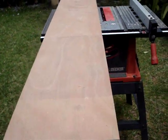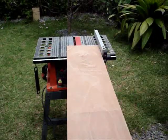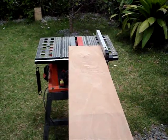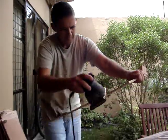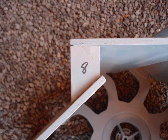The next step was cutting the blades. I used plywood and ripped each one of these down. On the top and bottom of each one of these blades, I cut 5 degrees on them. I sanded them smooth, and then I mounted all the blades on the hub assembly. At the top of all the blades, I mounted these blocks, and they help secure the blades at the top to keep them from moving around.